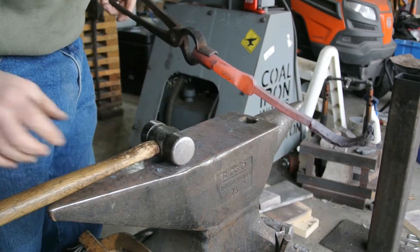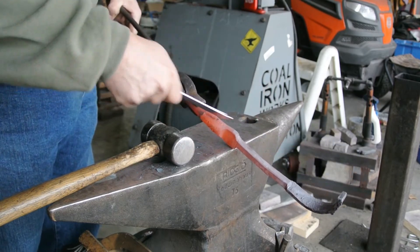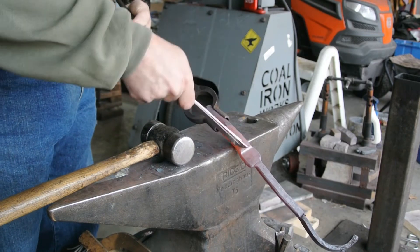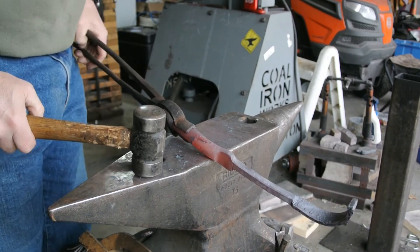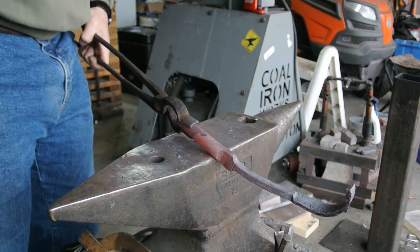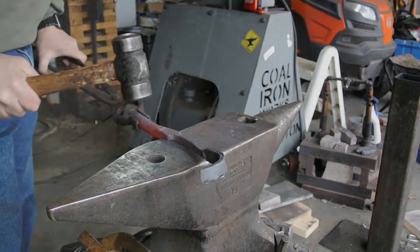As you can see, I've got this little spot right here — that's where the setdown goes. The rest of the tongs will come out this way. What I'm going to do now is isolate that by placing the edge of this piece on the edge of the anvil and then just gently working it — gently with a hammer, that is. That's kind of the start of it.